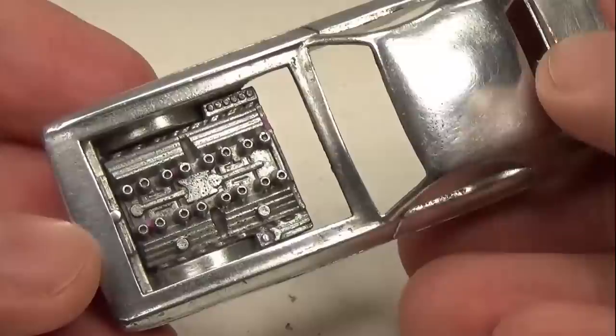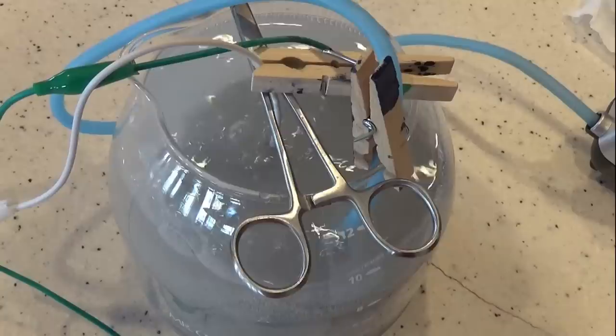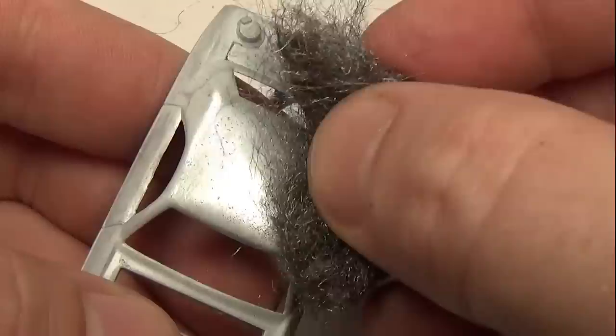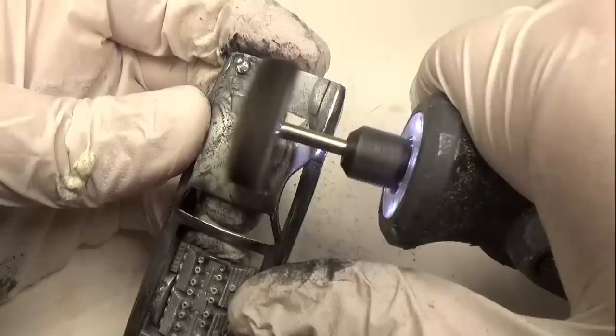You can see here how the body looked after several hours of sanding. I started to feel much more positive about this car, so I decided to go ahead and move on to zinc plating the metal — I'll leave a link below to this process. The zinc plating will add a small amount of metal to the car's surface, which will protect the underlying metal and, more importantly, give the car body a uniform brightness when I polish it later. After about two hours of plating, I'll remove the car, wash it, and allow it to dry. The deposit of zinc needs to be lightly sanded, so I use some triple-ought steel wool to remove the upper layer and shine it up. Once all the hazy metal is removed, I go straight into polishing it with the polishing wheel on a Dremel and some metal polish.